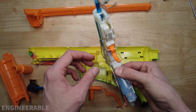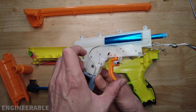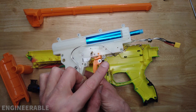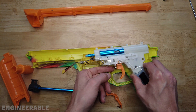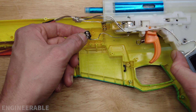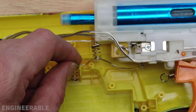The first thing to put back in place is the gearbox. The main thing to watch out for is that the trigger return spring goes in the right place. This trigger has its own return built into the gearbox, but it looks like they added another external trigger return spring to make it a little bit stronger. That spring goes over this post right here. Then put the magazine contacts back in place — the one attached to the gearbox goes on the left side into that slot.